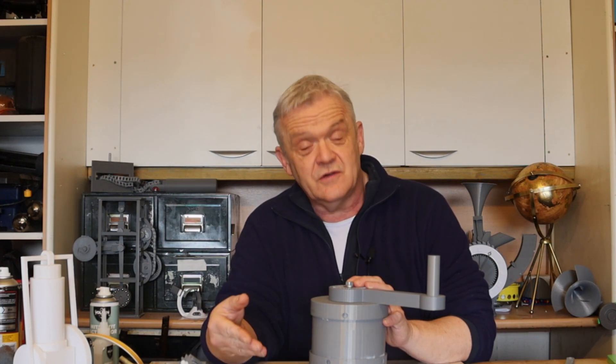This gives us a very compact unit with an easy-to-select set of ratios, which is why you see them used in transmissions all the time. You'll also see them used in drills, for example, as well as many other places. The way you work out the gear ratios is just like any other gear — it's the ratio of the teeth. So the ratio of the sun gear to the ring gear teeth gives you that gear ratio.